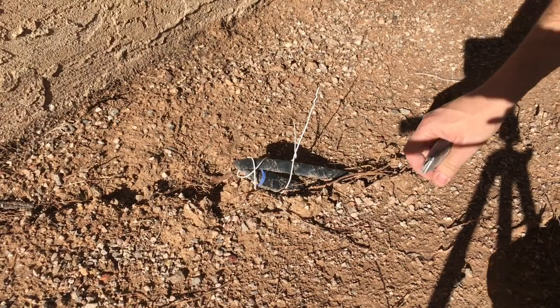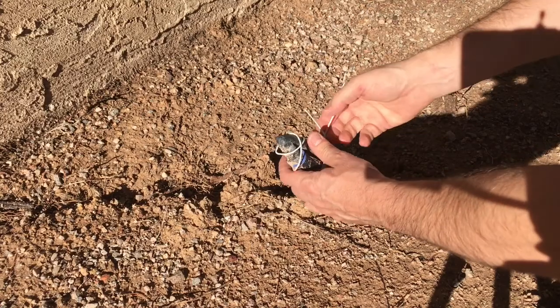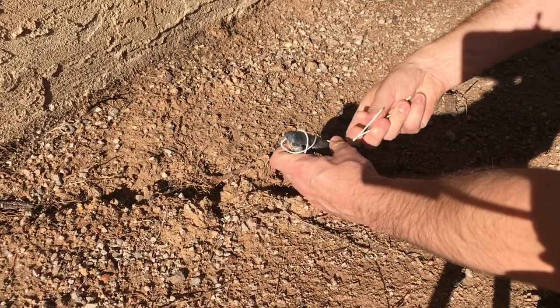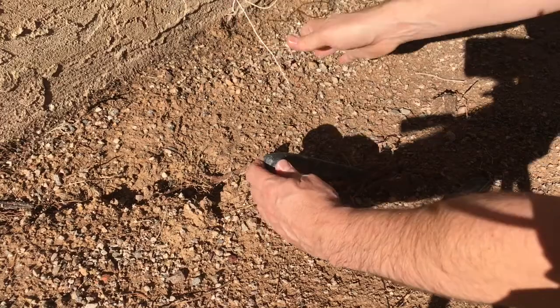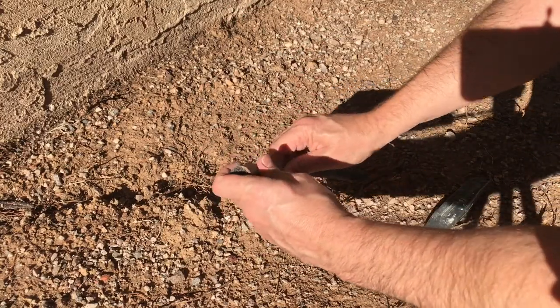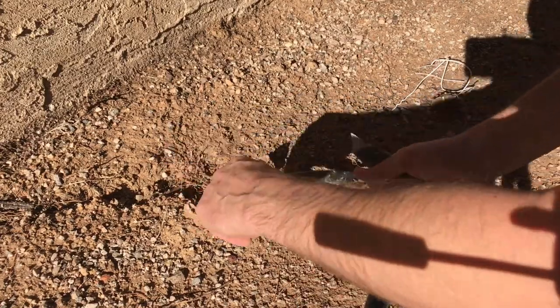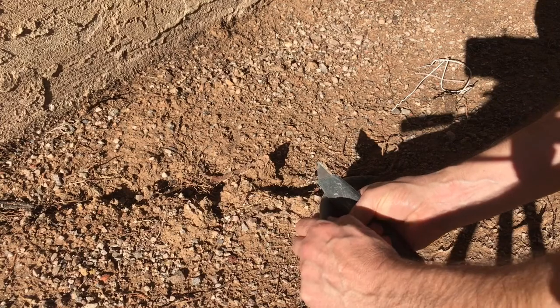So the water supply comes off of this side and connects about 5 feet that way, and you can easily tell that because this is the side that's pinched off so the water can't flow through. I could reuse this coupling, there's nothing wrong with it, but I already bought a new one, so why not? So you don't need any glue or anything on this.